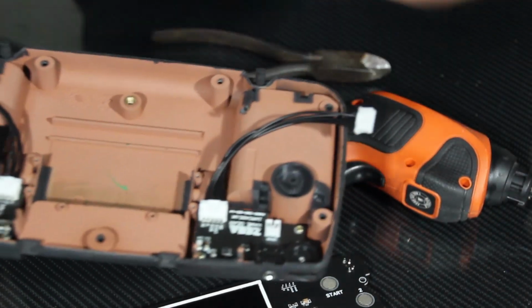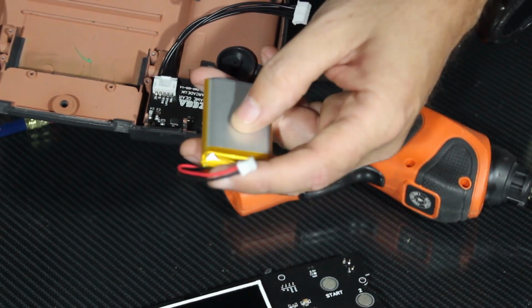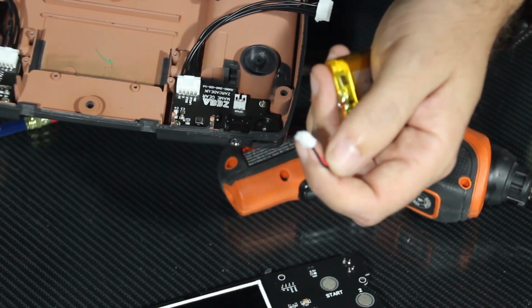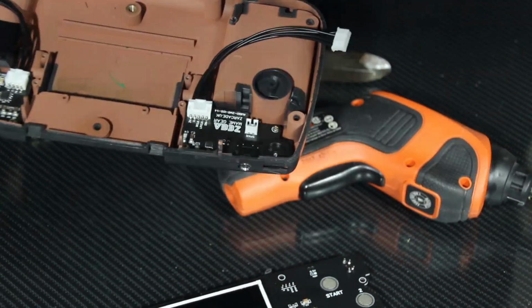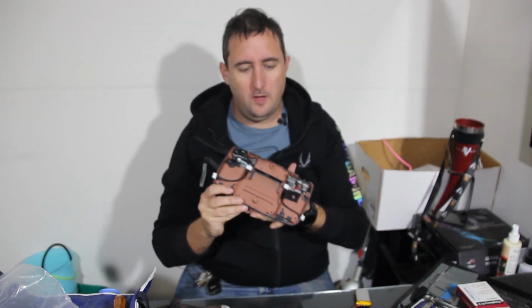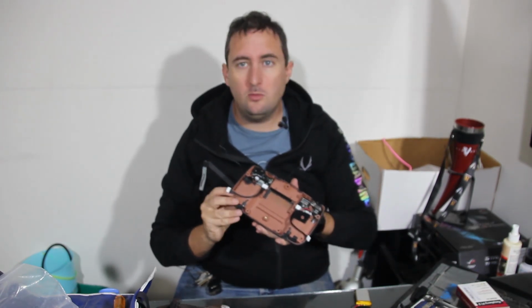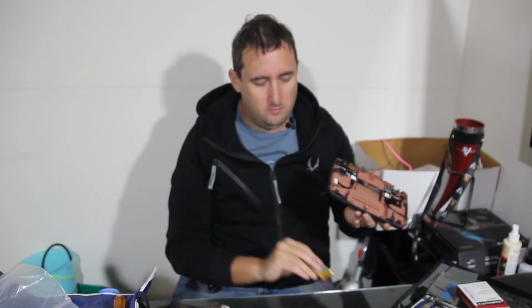However, the other battery we bought will have to be modified to have a longer cable. So I'm going to have to cut and solder some longer cable onto that and make sure that that's all working well before we install it into the unit. Luckily for me, the cables I snipped from the existing AA battery compartments were perfect length already and the correct gauge to reach it. So the only thing I needed was a soldering gun and some heat shrink and a little bit of patience. And we're going to get this installed right now.